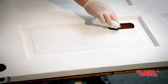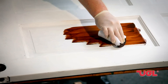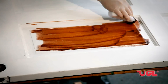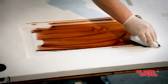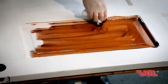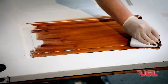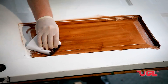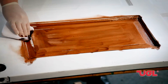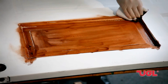The first step is to apply a very thin coat of stain. I'm working on the inside panels of the door first. A very common mistake in doing this project is applying too much stain, so you really want to make sure you have a nice light coat. If it's too heavy, it doesn't work so well. Work it into the corners really well and cover the whole panel with one light coat. Don't worry about the corners of the panel just yet.